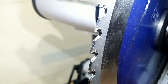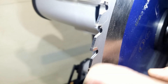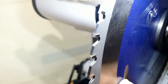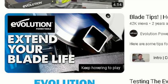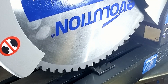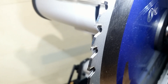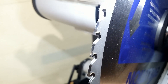Let's see the teeth on this brand new saw. When you read reviews, some people swear by it, others complain it doesn't last long. I think adding the shim to straighten the blade will help extend its life. The producer has a YouTube video presenting cutting techniques to prolong blade life — worth watching since these blades are not cheap. The blade works best using a touch-and-go technique rather than a scratch-and-go technique; the idea is to shorten blade-material contact time whenever possible. Working on my projects, I will document cuts I make and report in a following video the condition of this blade after 10, 20, and so on cuts. Come back to my channel and see the results.